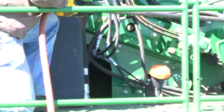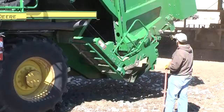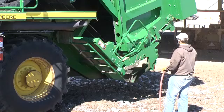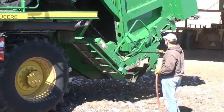Make a final check and remove any remaining debris from the area under the accumulator at ground level. Blow debris from the ramp handler optical sensors, sides of the gate, and the handler.